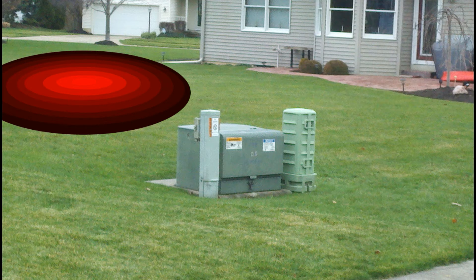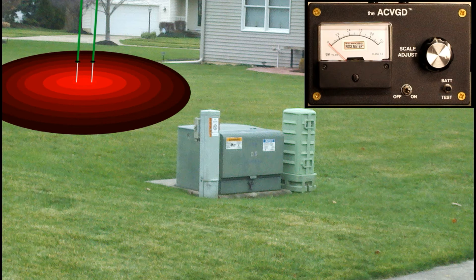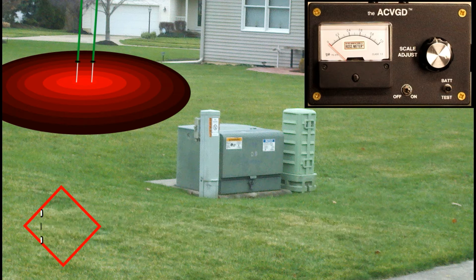Because the voltage gradient rings on the ground are in the shapes of circles, there is a difference in voltage between the rings. When you are directly above the fault, you are in the bullseye. In the bullseye, there is no difference in voltage detected between the two probes in the same gradient area. Mark this point precisely, then continue to probe the cable route for additional faults.